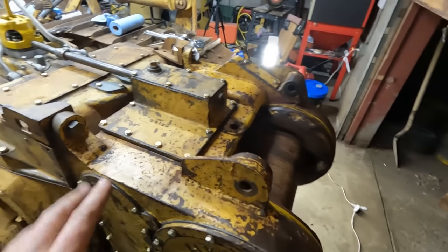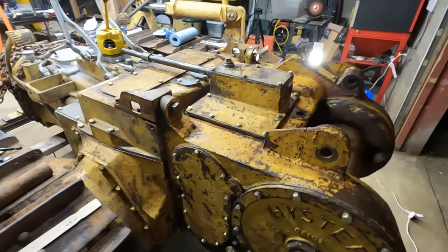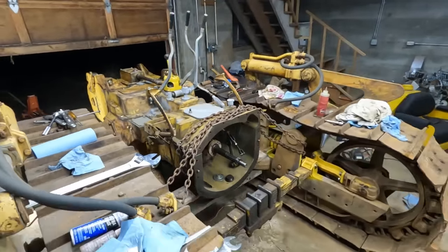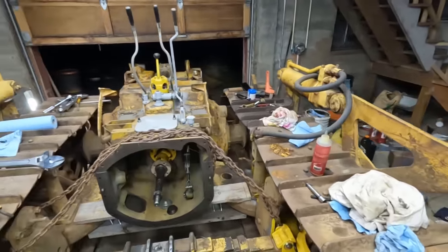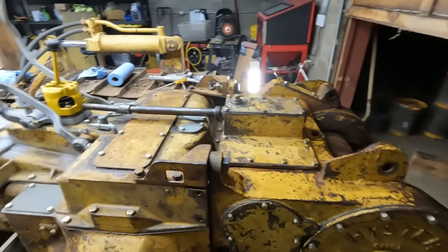The shaft has some slop in it but this brake compartment — I'm pretty sure they expected water to get in there, that's why there's a drain hole. It's just like drum brakes on a car. I've coated everything in here with Glyptol so it won't rust. I am concerned about this control shaft hole — I'm going to get a freeze-plug type thing and hammer it in with some RTV to seal it. I haven't put any fluid in the transmission or the finals yet because the next step is pressure wash and paint. I should have split this into two or three videos — it's been five or six weeks and I've been working that entire time. From now on it should be more regular. For questions, best to send me a message on Instagram or email rather than comments.